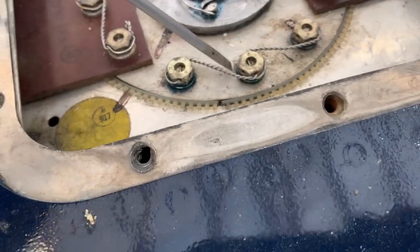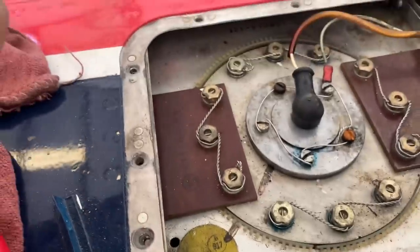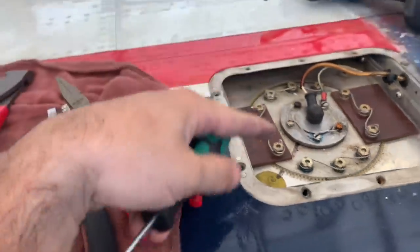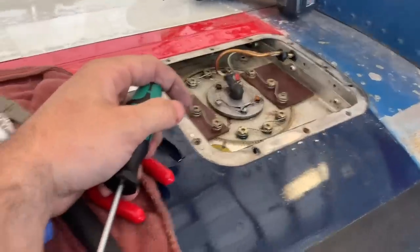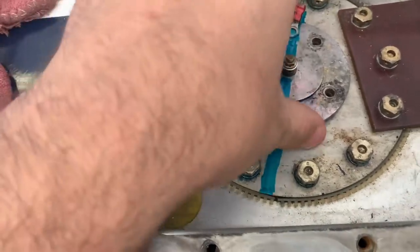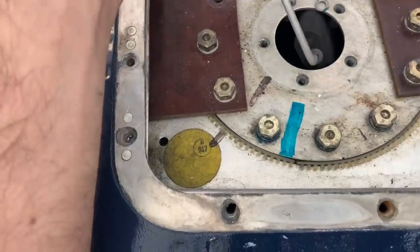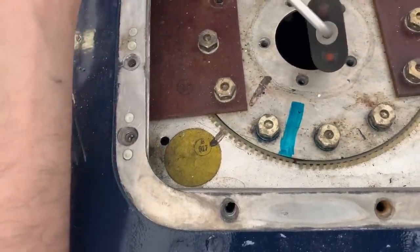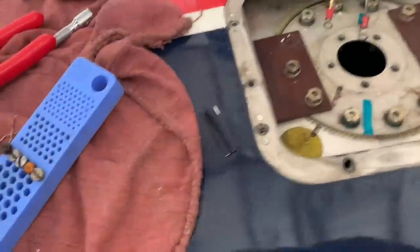We got blue on top — if there's blue on top, there's a gasket underneath, and sure enough it's probably coming out of that gasket. That is a different tank than that one; this one runs under the nacelle. Just more evidence of leaky leakies. Make a mark so you remember which way the fuel sending unit goes. I think all the fuel was pouring out when it was full because the tops weren't tight enough. Got it out. That's my theory.